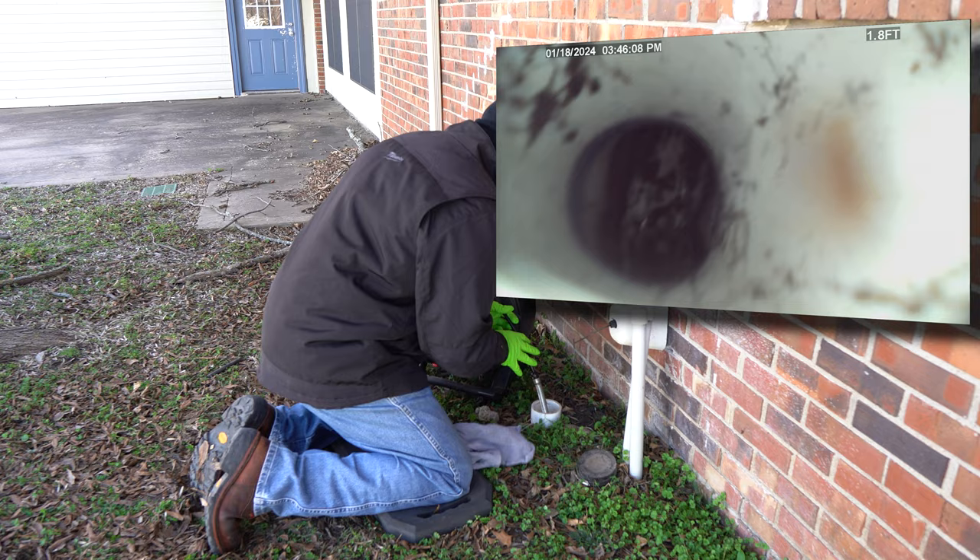I don't see any breakage. I've got a little bit of standing water right there. Now I'm completely underwater. There's definitely some fecal remnants down there. Not sure what that brown stain is on the camera lens - we'll figure that out later. I don't want to go too far because I don't want to drop down into the septic tank. I'm about 11 to 12 feet in, which is getting really close to it. At this point I don't see any breaks.